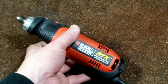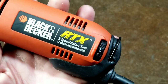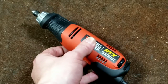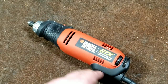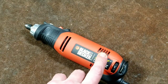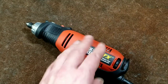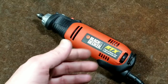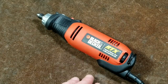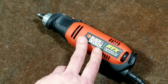In small rotary tools, permanent magnet motors versus universal motors — you get a little more top speed out of the universal, but as far as power and longevity they do pretty well. One thing on the Dremels is you can replace the brushes, but on this unit you can't because the motor is what's known as a canned motor — a permanently assembled motor. Unfortunately when the brushes wear out you're stuck, and the commutator is often only thick enough to last through one set of brushes. That said, the RTX can be had for around $20–$30 online, so it's pretty cheap and competitive.